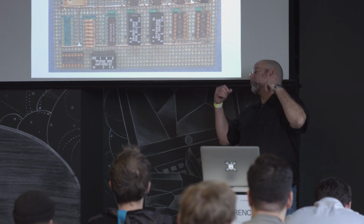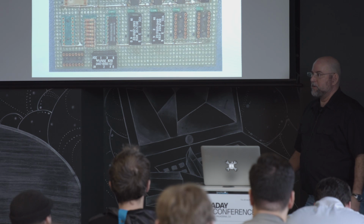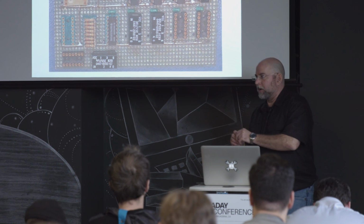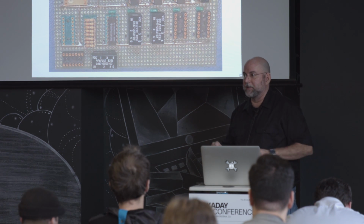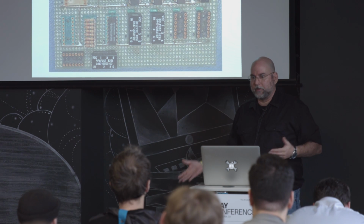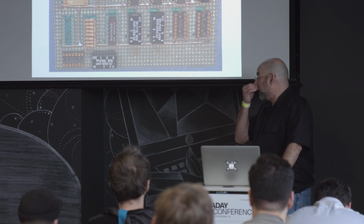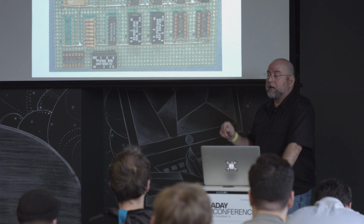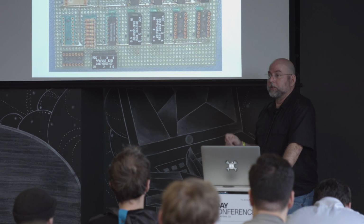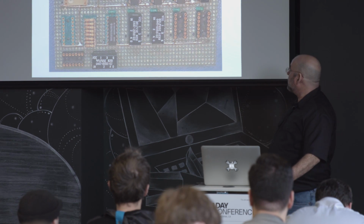This thing would make the most beautiful colors and then screw the DRAM timings. I mean, royal. Down in production, they're hanging capacitors off lines to get it shipped, so it'd be under your tree, even though that capacitor was like no good once the thing warmed up. And we were actually not allowed to go down in production to find out what they were doing to get these units shipped. So the VIC chip was beautiful, but it had its issues.